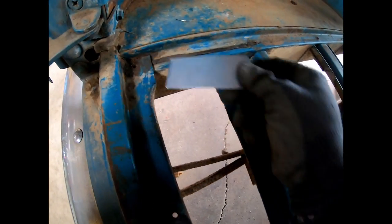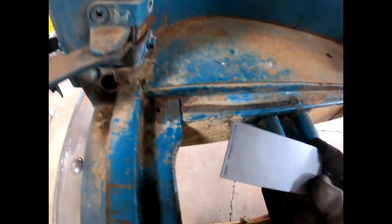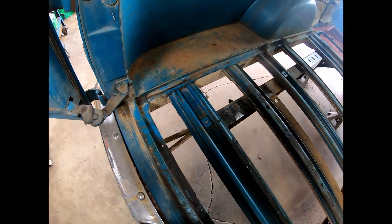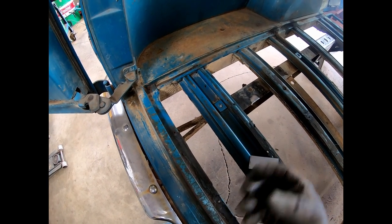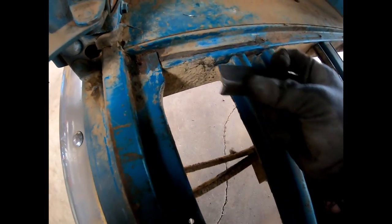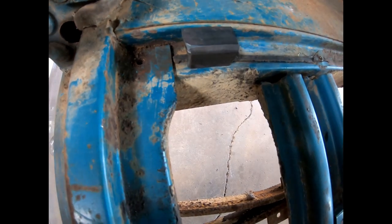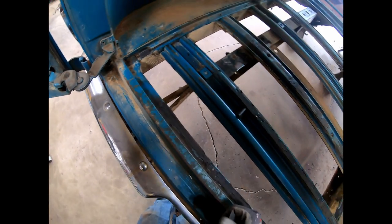So we don't want to just put sheet metal in there, because obviously it'd leave a big lip back here. So it'd be nice to have a break where we could break that whole length with a nice sharp edge, but I don't have one. So I started looking at what I do have, and I took a piece of square tubing and I cut it where each corner is rounded, opposing corners. And if you take that, then you can set it down in there and see that kind of fits up real nice.